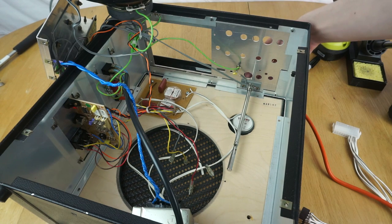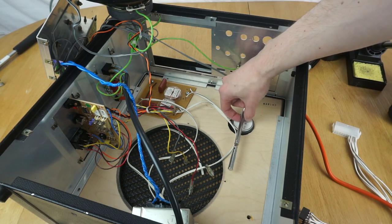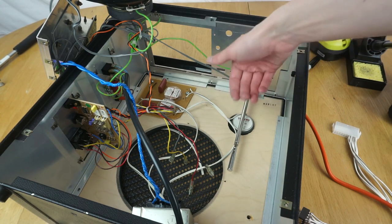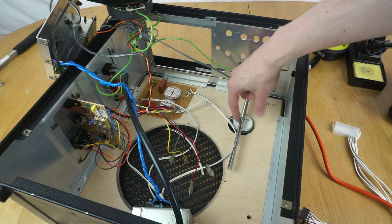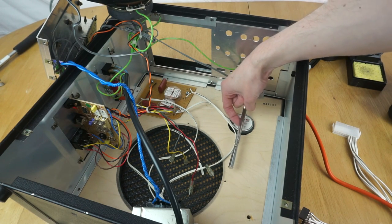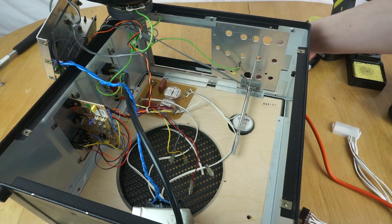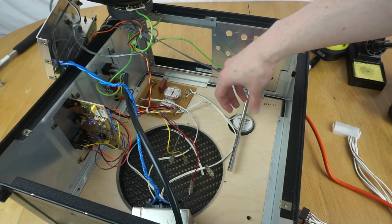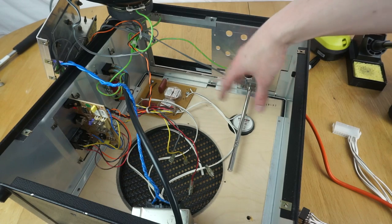The good thing is also the antenna isn't caught on the speaker, there's plenty of clearance between that, which was my main concern when I was choosing tweeters, because I couldn't go for any sort of horn type thing because it would come far too far into the machine and hit the antenna. So that's good, there's probably about 5 mm clearance, which is absolutely fine. So yeah, that moves absolutely fine over that. That was my main concern with this, and that isn't a problem, so that's great.